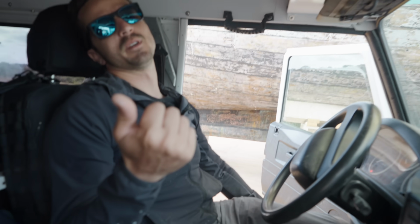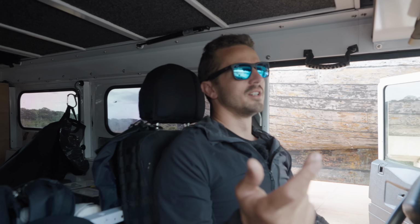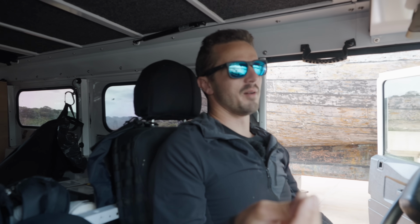So, yeah, what's the plan today? Today it's less windy, Kika's here, and we're starting earlier in the morning, so it's cooler. So I think we're gonna have a better, more productive day. But we're gonna start by pulling off the peel ply and the plywood from what I did yesterday and see how it works and see if there's anything that needs to be adjusted or modified. And then we're gonna do the V-berth. So template, cut glass, put the plywood in, seal it off, glass it in, and we'll be done. Sounds like a fun day.